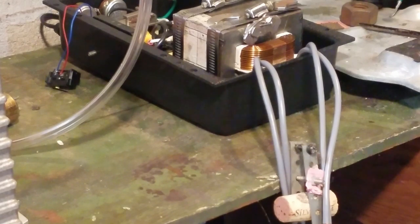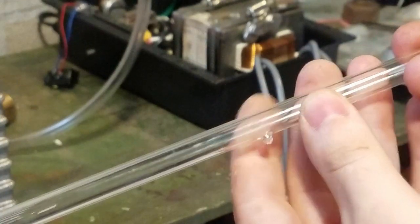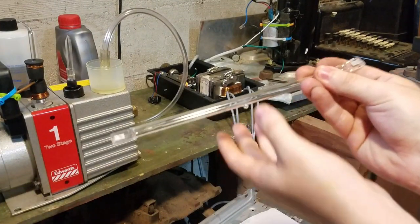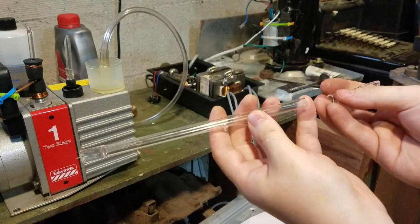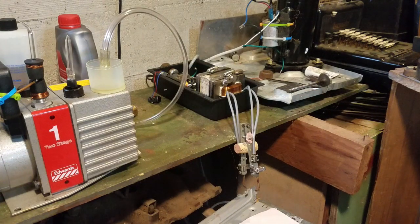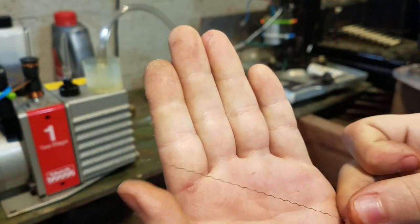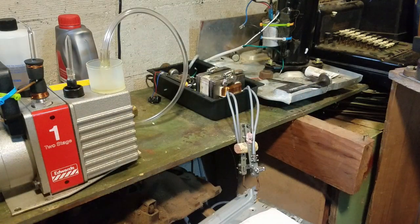The tungsten wire that I use is recovered from an old halogen bulb. And when I recover it, it's still a little curvy, so I have to flatten it out. Like from one of these. I got, I think, 5 or 6 of these for like 50 cents each at a surplus store. So what I've got to do is heat this tungsten up with the torch, and while it's still hot, flatten this out with some pliers.